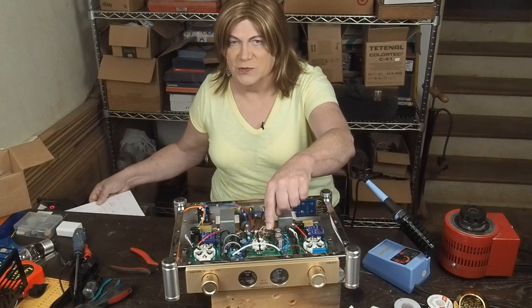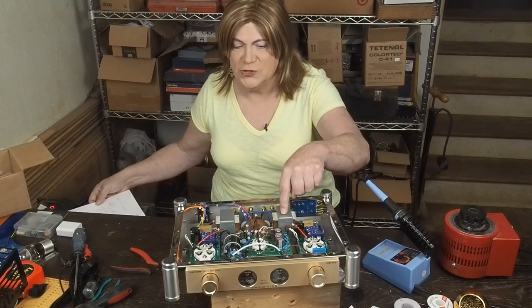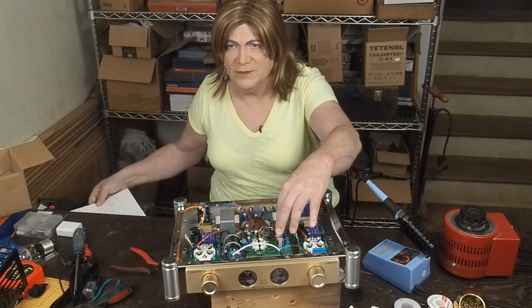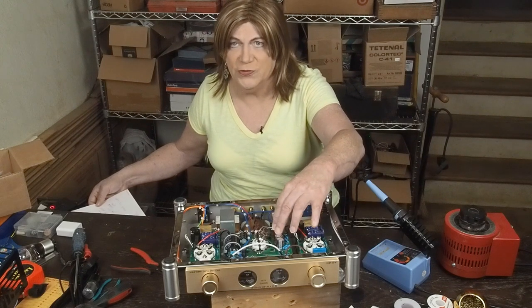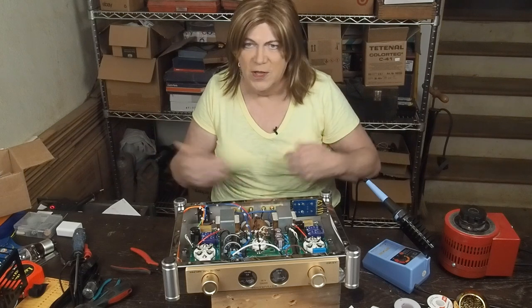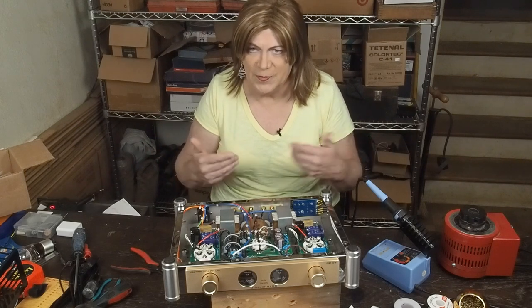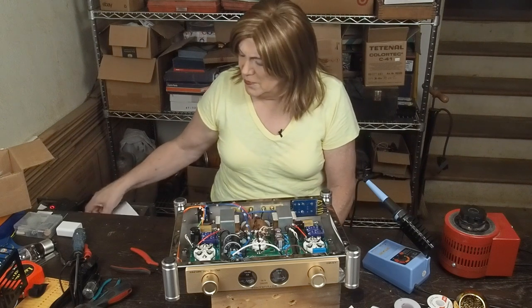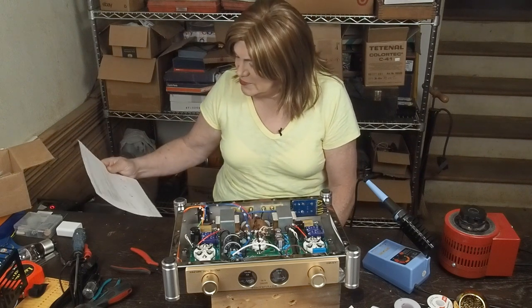With or without this resistor before the first choke, with these series 33 UF caps, I made a mistake last time, I forgot, when you put them in series, it halves their capacitance. So it ends up being a 16 UF that, I'll give a little sheet here where I look this stuff up.